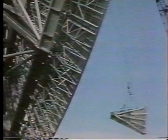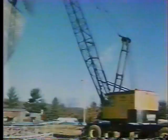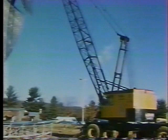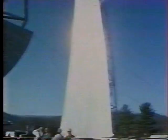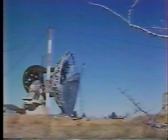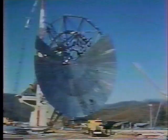Each of these assemblies was trucked over 750 miles from the fabricator's shop. Some were bumped, bent, and strained in transit and during handling on site, but instrument checks demonstrated satisfactory compliance. Each element can take over one-half inch of differential deflection among its four supports and will return to its paraboloidal shape — no deflections are expected in excess of three-eighths of an inch in winds up to 135 miles per hour. After final adjustment, the panels will be painted white with a heat-diffusing coating material; they are not painted prior to erection so as not to lose the 90 reference marks by which their shape can be measured.